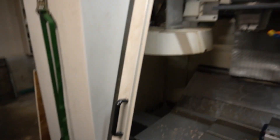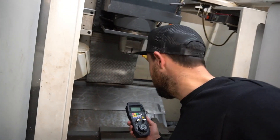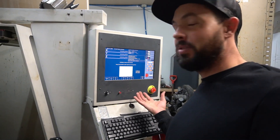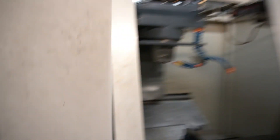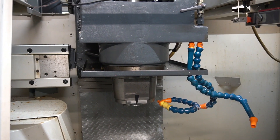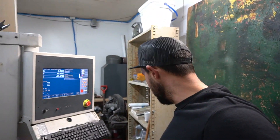This right here is probably my favorite part so far — this is Centroid's wireless MPG, and all the control here is wireless, which is super nice. If I want to look at a part I can get in there and actually be inside the cabinet without having to stand here spinning the dial. So let's home the machine quick — Z is going to home here, you can see it moving up, touches off the limit switches a couple times. Now X is homing, and then Y goes and homes.